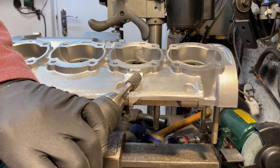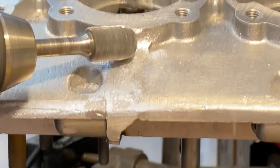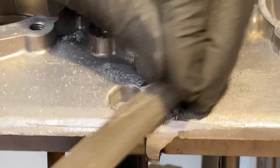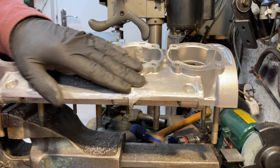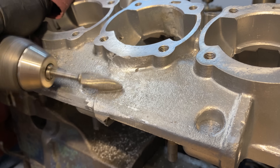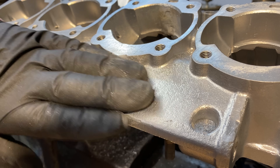With the welding complete I use my rotary burrs to start cleaning up the welds, starting with a coarse one. I gradually remove material a little bit at a time until I retain the original contour, then use a file just to clean along the front edge. With the surface reasonably smooth I use my fine carbide burr to try and recreate the cast finish. To finish off I use a bit of emery cloth — this can take quite a while to get the finish you're looking for, but you have to persevere and you get there in the end.